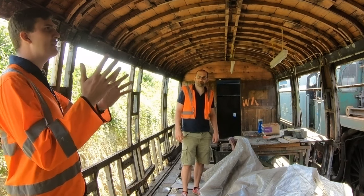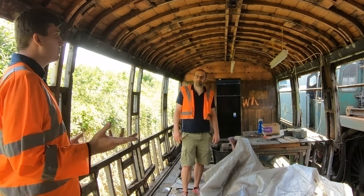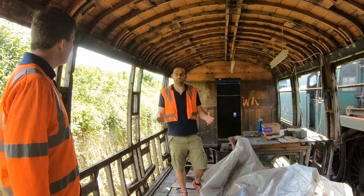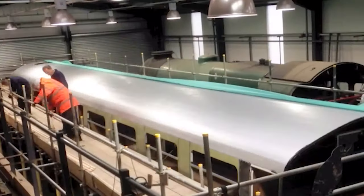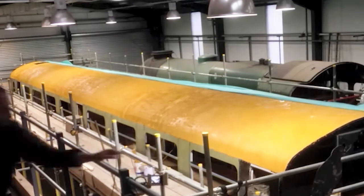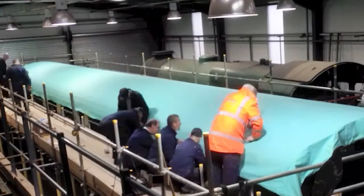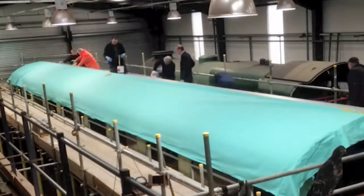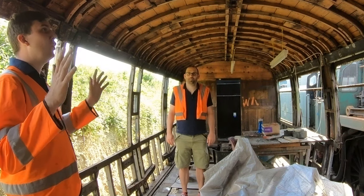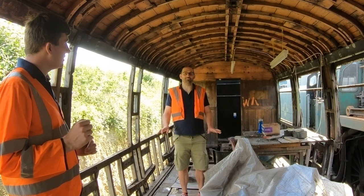So with water and wood — from my experience wood bows and softens, which isn't ideal. We make the frameworks out of really nice hardwoods which are pretty stable, and we make sure they're all painted up. The external waterproofing is steel cladding on the outside, and for the roof we put a canvas roof on which we bed down using a linseed oil-based compound and then put a whole load of paint on top. We painted the last roof something like 12 times just to keep the water out as much as possible.